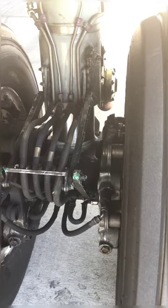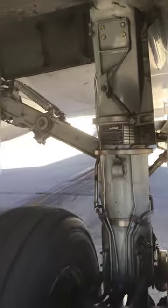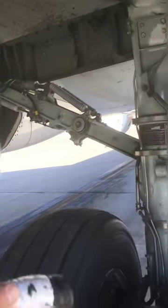We come back to the back end of the gear. This is a better place to look for the brake pin wear. Number four brake has plenty of pin on it; number three brake is still pretty good. We want to make sure it's secure. When looking at the brakes, make sure you've got no dust and nothing's coming apart. We'll clean the strut with the proper cleaning — moist towel provided for us. Everything dry — no hydraulics, no leaks. This one's a good one.